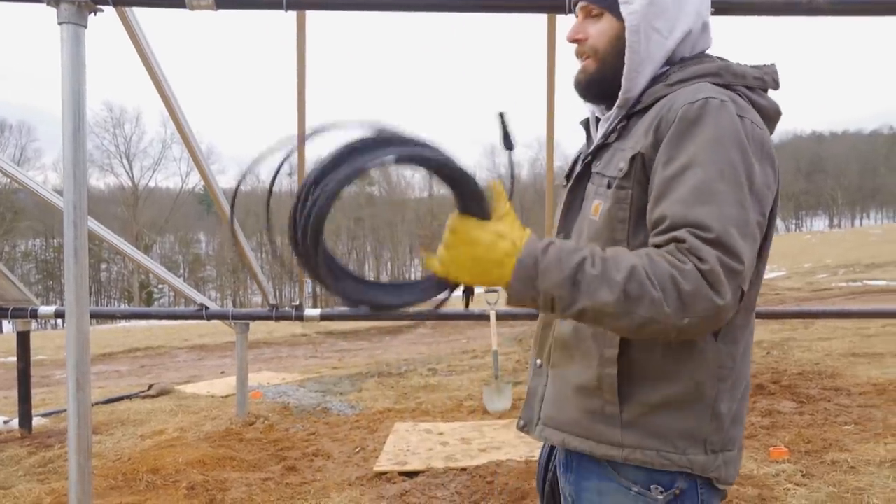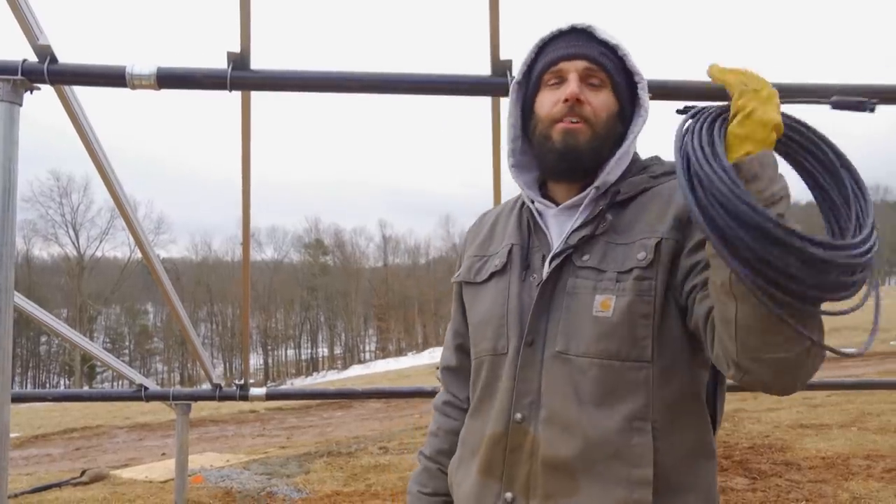I had an epiphany. I thought these were 25-foot lengths, but they're actually 75-foot lengths. As you guys know, we're installing 20 more panels — two more strings going back to the powerhouse with two new charge controllers. The original plan was to intercept the pipe in the ground and pull it over to set disconnects on that side of the stanchion. But since my MC4 cable is 75 feet — not 25 — it's actually long enough to come back towards the combiner box side. So we're going to pull all the new wire from the charge controllers through that same pipe and up right next to the combiner box, mount a new disconnect, and do everything that way. We actually saved ourselves a few hours by doing it like that.